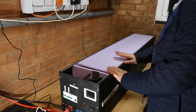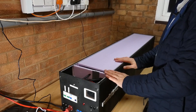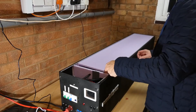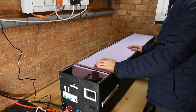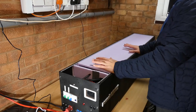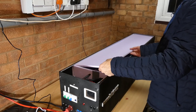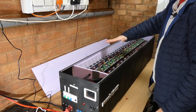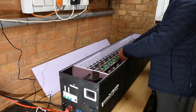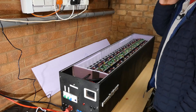So we're back in the garage. I suspect this is probably 90–95% fully charged now, but obviously we've got the cell imbalances, so I'm going to switch the inverter off. This insulation is actually doing quite a good job of keeping the cells above about 10 to 15 degrees at the moment. None of the balance modules have actually fired off at all since I've been using the battery, which has kept the temperature down, but just the charge and discharge cycle seems to be keeping the heat in quite nicely. It's about 20 degrees C in the middle after the full charge, and that's been charging at three kilowatts for about four hours.